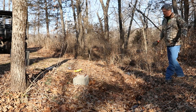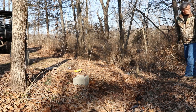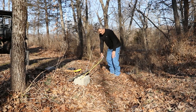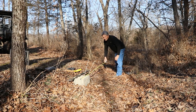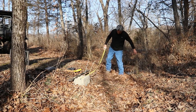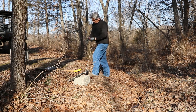I'm going to check my orientation for the square coming across this — that's going to hit about right. Looking good so far guys. Now here I'm going to use my tape measure as a straight edge, and if you don't put a kink in your tape, it will get you pretty close to level as well. I'm centering that up with the edge of the block there on the inside of the edge, so that's going to get me about right in here. I'm going to keep these seven feet apart, just mark this off and dig this one in. The coat's already off — it's already warm out here, beautiful morning.